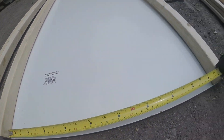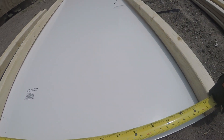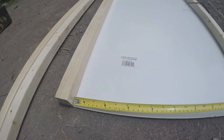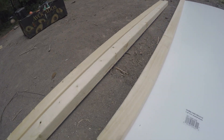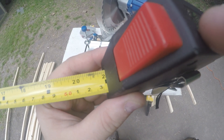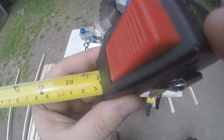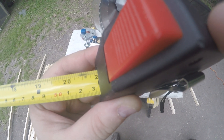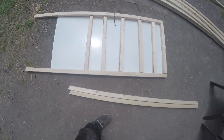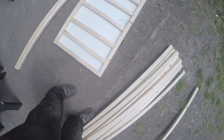I'm going to measure the space between the two legs that the board will sit on to make the cross pieces, then we'll cut some pieces and put them together to make one side and the other side for the A-frame. It works out at 21 inches exactly, so we're going to cut three of these out of the 2x2s. They're going to be used — three each side — for the supports. Now we've got all six cross pieces cut, we can go ahead and take three for one side and three for the other and connect them to the side posts.